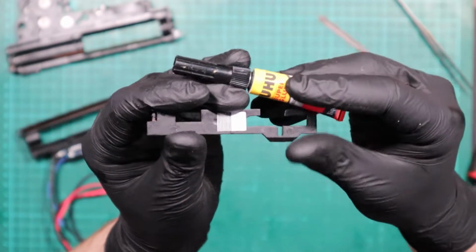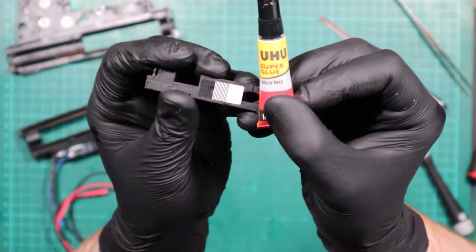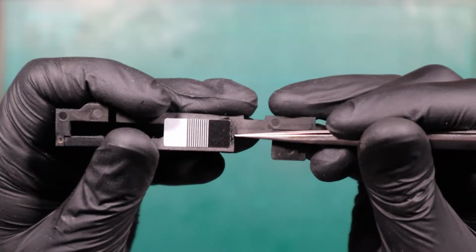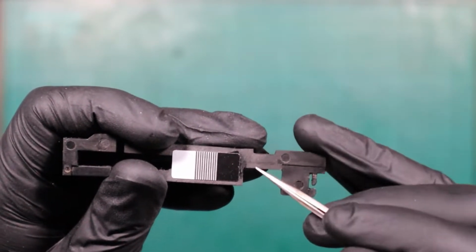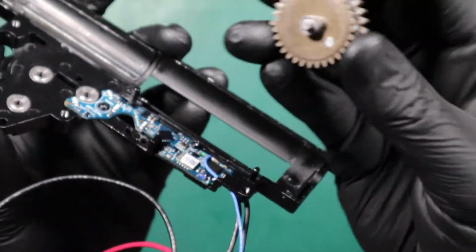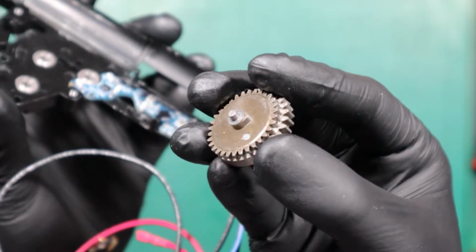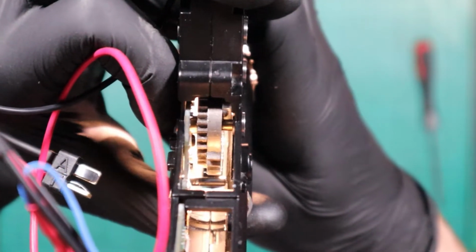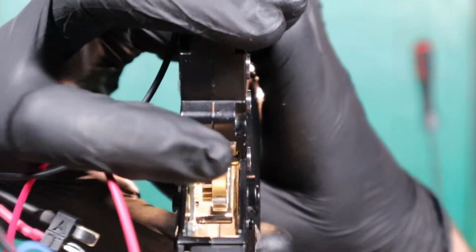It turns out however that the location of the sticker according to the instructions does not always have to be the best, because after applying it this way, the system only worked in semi. The sticker had to be moved a little further from the edge so that the unit could detect the selector settings. For proper operation of the unit, the sector gear must also be properly installed. It must be high enough above the unit so that it does not touch the screw, but low enough where the sensor can see the element on the bottom of the gear corresponding in the system with a normal contact block for interaction with the cutoff lever.